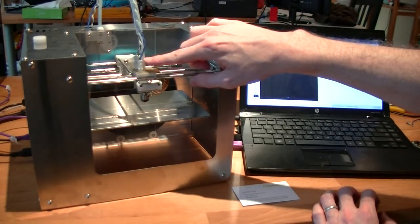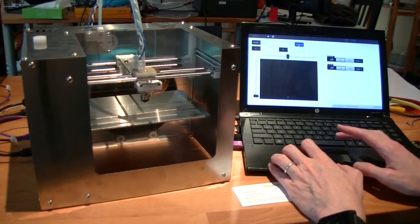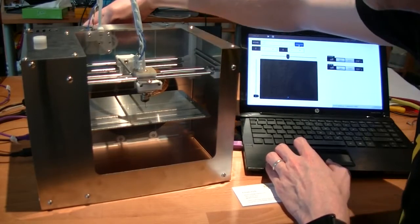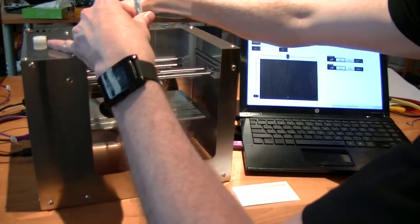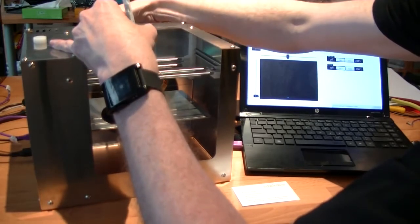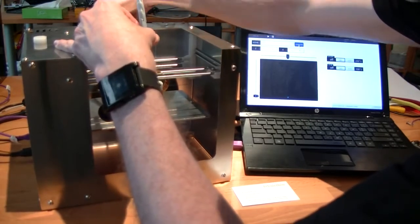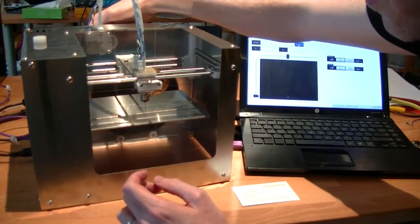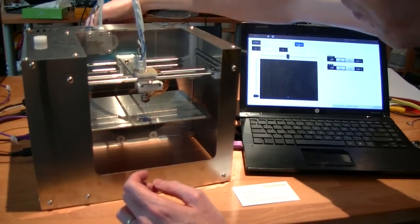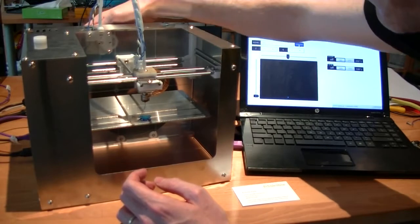Now, currently the filament's right here. I prefer to turn off the motor and manually run it until it gets into the hot end, because sometimes it meets a bit of resistance going in, and you might want to just kind of slowly guide it in. So like right now it's there. So for production feed tubes, we're gonna change the design a little bit so that that should be a little bit easier. But you probably, with the current ones, you will have a little snap like that.